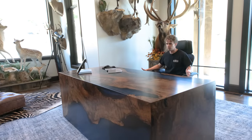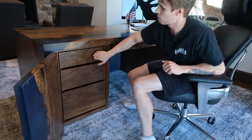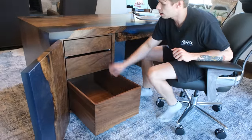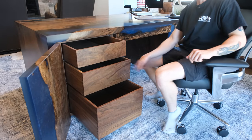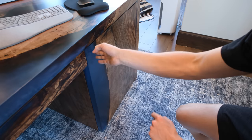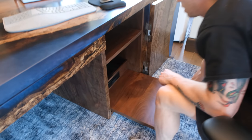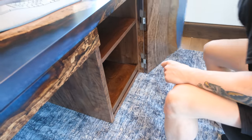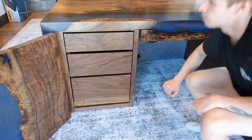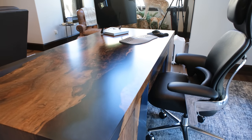To walk you through the function of what we built: on the left side we have matching doors along with three drawers that have Bastogne walnut fronts and dovetailed sides. There's also the pencil tray that comes out with a matching front. On the right we have the printer tray — and we can thank our sponsor Docking Drawer, who supplied the hardware to allow the outlet to plug in the printer. That's got all the nice Blum soft-close hardware. The main feature of this desk is the way all three sides waterfall down — both edges and the back.